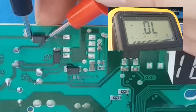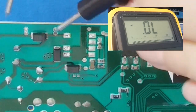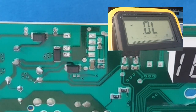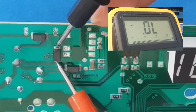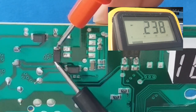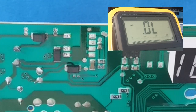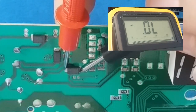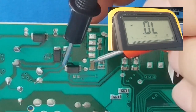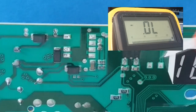This is a diode. In one direction, there is not conduction, inverting the leads. Now there is conduction and that's a diode. This is a healthy diode. No conduction, but what we saw was a capacitor charging. So that's okay. My next diode looks healthy. Inverting the leads. No conduction. That's okay. I have good diodes.